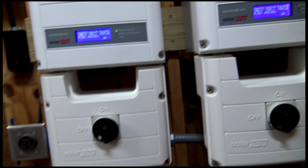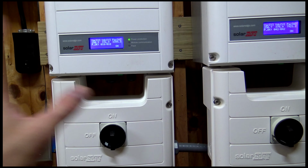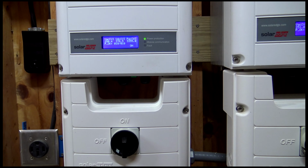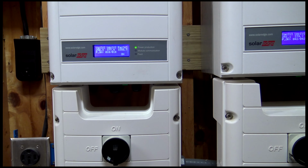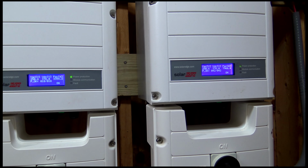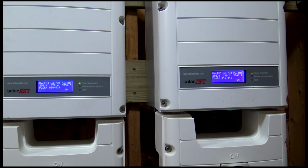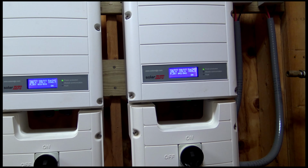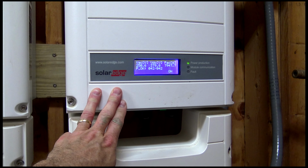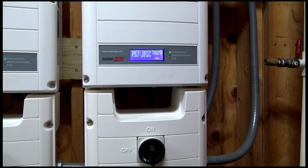And like I said, it just adjusts the MPP down, the maximum power production point. It skews the voltages and the currents to decrease the efficiency of the panel so that it floats right at 6,000. So anyway, that happened because it was a cold, clear day. The solar panels work better when they're cold, and the sun was right in the right area, and it was just an absolutely brilliant, clear, blue sky day. And the 42 solar panels that were connected to this inverter were really just pumping the juice out. So anyway, that was something.